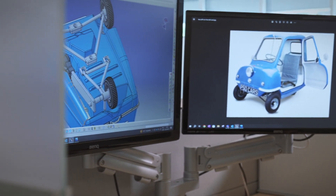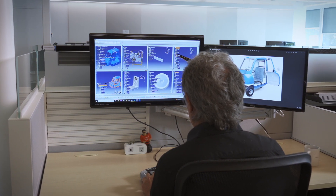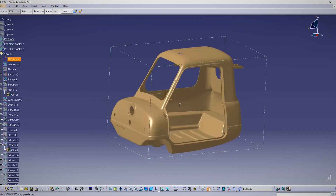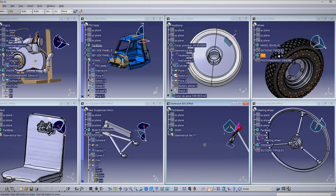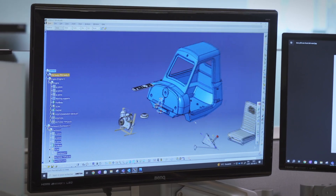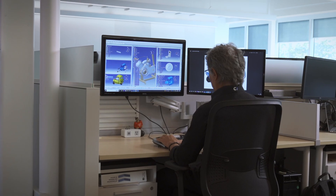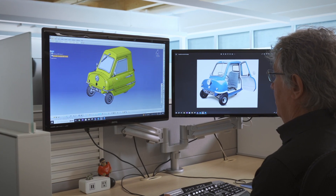Our objective was to make the model as realistic as possible, but we also took into consideration how it would be made and the scale at which it would be printed. We had scans of most of the components that we used as a reference for CAD design, and built some of the more minor components such as the wiper or handbrake lever based on pictures and observation modelling. We then added mounting pins and slots and used the CAD model to build the assembly instruction manual, delivering the very first fully 3D printable 1:16 Peel P50 miniature model based on the 3D scan of an actual real P50 car.